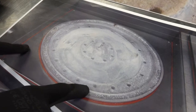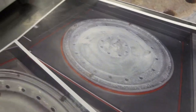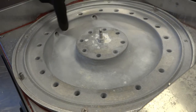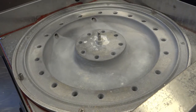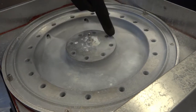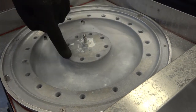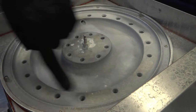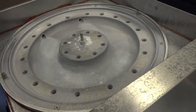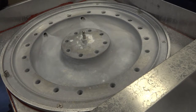As demonstrated on the actual steamer, these are your two horizontal water inlet ports where the water is injected into the racetrack. The inner vertical steam ports and the outer vertical steam ports are how we redirect steam down below where your food product is in the toast chain.